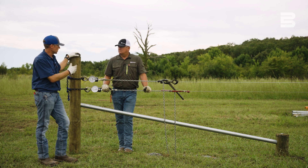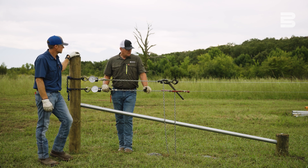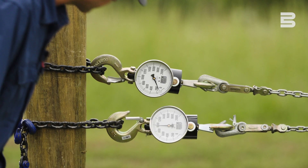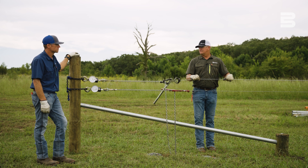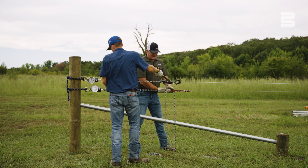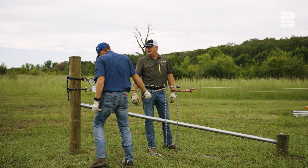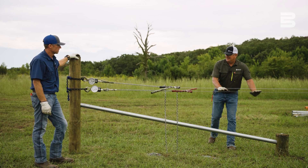When they do that, that fence is going to stretch and then you're going to have sag. Cows will continue to do it and make that situation worse and worse. So let's say the weather was to warm up and this fence relaxes just a little — what happens if we take just a little bit off that low carbon? One rotation and you're maybe below a hundred pounds. Now we have a slack fence. Now let's drop that same one rotation on the high tensile. We dropped to a little below 800. That's still not a slack fence.